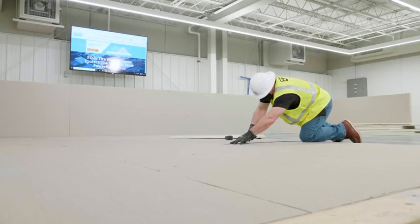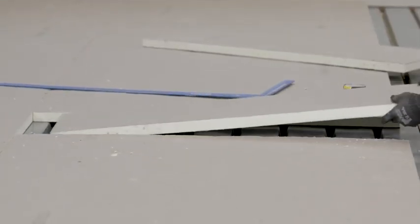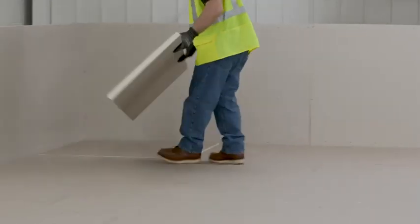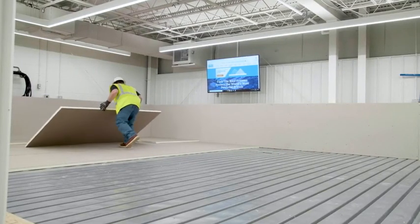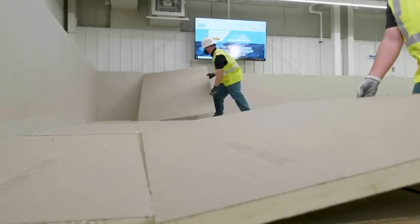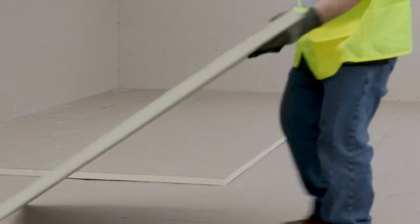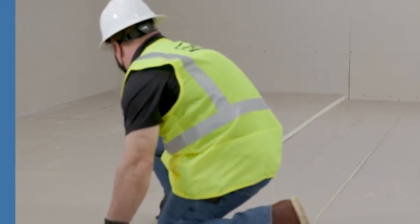Cut out and replace any damaged corners with a 12-inch by 12-inch minimum insulation piece. When a cover board and or multiple layers are installed, each layer will need to be offset from the previous layer a minimum of 12 inches on center. This will provide a thermal break and the amount of thermal loss between the insulation will be minimized or reduced.